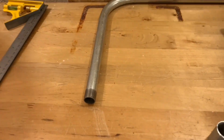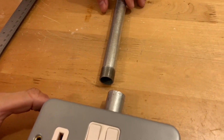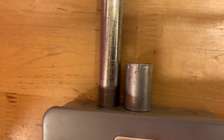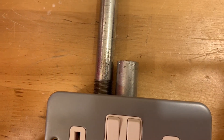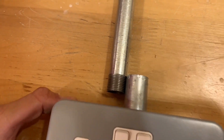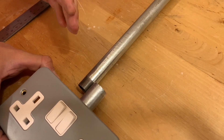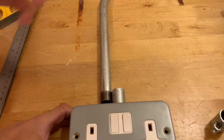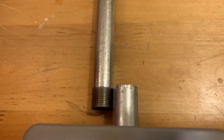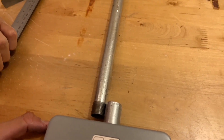Now imagine we had a socket outlet down here — we might have been measuring from the back of the bend to a fixed point. In that position the conduit would be too long and you'd lose all the threads. Unless you pull it down to half a coupler, you'd measure that 300mm from the back of the bend to partway — halfway — through that coupler. Learners tend to prefer measuring up to the accessory and trimming down half a coupler, about 15mm. Or you can subtract half a coupler from your measurement at the beginning. If it was from the back of the conduit to the midpoint of the coupler — 300mm — you'd be spot on. If you measured to the box itself, you'd cut off half a coupler and recut your threads.